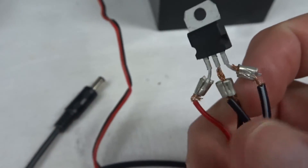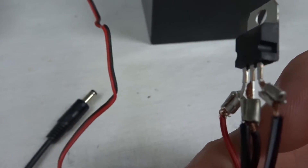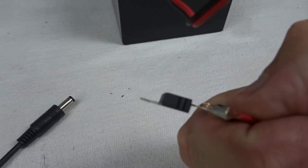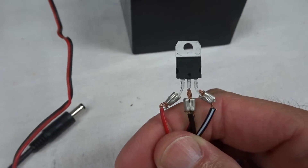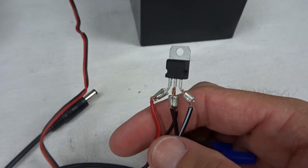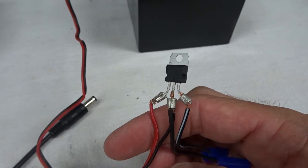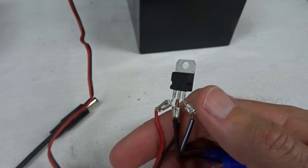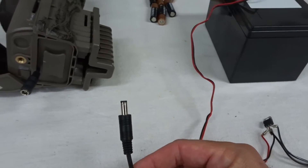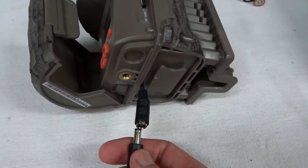I'll put this in the description, but you take a little 6-volt regulator — I wrote a '6' on the back because I have 12-volt ones too and they all look the same. With the fat belly part facing up, the red wire coming in from the left is from your battery, the black wire in the middle is from your battery as well, and the black wire from your cord going to the camera shares the common ground in the middle. The outside wire is your hot going to your plug, and you'll end up with 6 volts at the plug. These are cheap on Amazon — I'll leave all that in the description.